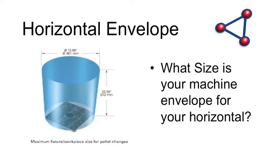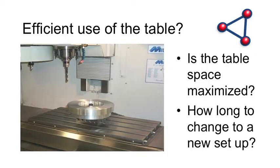You've got to look at not only the table size but what your travel sizes are, and build to the smallest travel available — that becomes your standard. Same with horizontals: look at the work envelope, how far you can come out in Z-axis. Once you have all the constraints, you can create a standard: here's how big, here's how tall, here's how wide. Here are my parts and how they group. It seems simple but most facilities don't go through that process, which is why you can't easily transfer things from one machine to another.